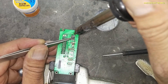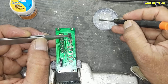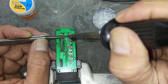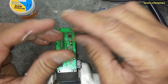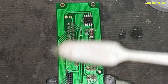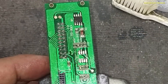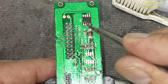Now I will apply hot air. When the pins are aligned in the center of the tracks, we will apply hot air. I will throw hot air down both sides equally. Clean it. Now inspect the IC for the index pin and for bridging with the second pins. Everything is clear — there is no solder droplet, so this IC is installed properly.